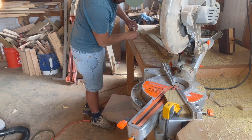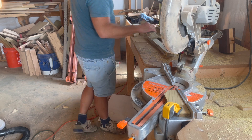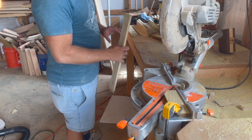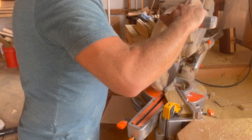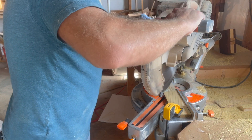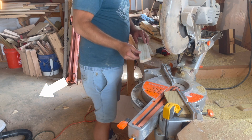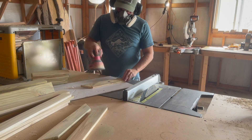This is a good opportunity for a little PSA on workshop safety. When you're using stop blocks, make sure the blade stops spinning before you lift it back up — otherwise the piece between the blade and the stop block can get caught and shoot out. Because I was making a bunch of repeatable cuts it's really easy to get complacent, and that's exactly what happened. Luckily it wasn't bad and the piece didn't come flying at me, but you never know, so be safe.